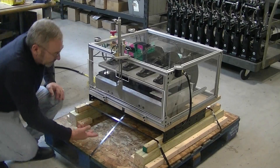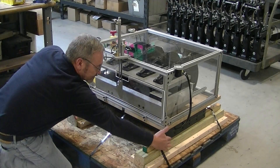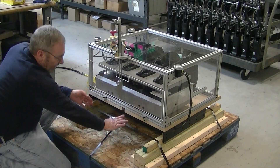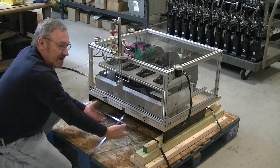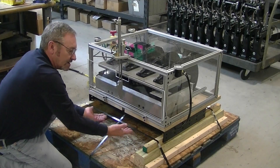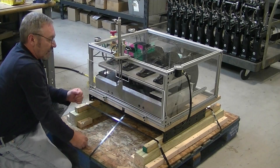Now when you pick this up, your forks are going to have to go under here to the machine. You're going to take the bolts out of the side here. Everything's strapped down really tight on this center cross member. There's going to be some hoses in here that might interfere with the forks, so make sure your forks go in to pick this machine up without pinching any hoses.